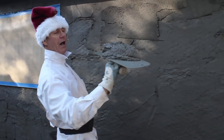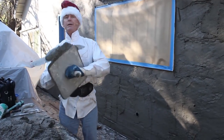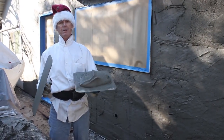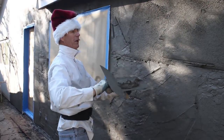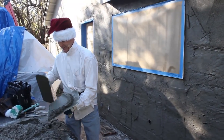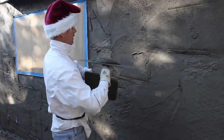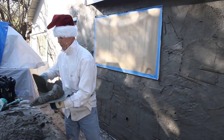People also ask why I take mud off the bottom of the hawk. It's called — I don't know what it's called — but I tilt and turn. I tilt, put it on my trowel, turn, and drop it. For me, after many years, that's easier. You can take mud off the top too, but it doesn't save much time. It's four to five turns that way versus three with a full hawk. Some folks say in their union you'd be fired for not pulling off the hawk right — but it's not the hawk or trowel, it's the experience.